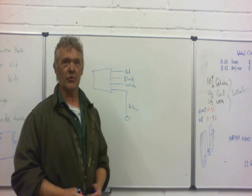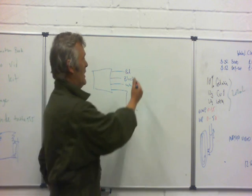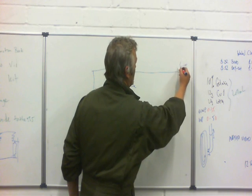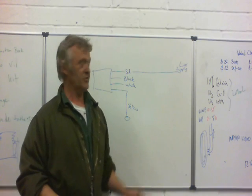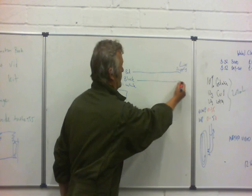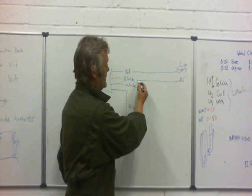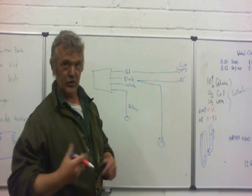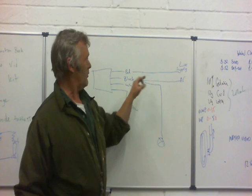The colours will change depending on which one you buy, but they're essentially the same thing. The red is obviously the live, and that one goes to your live supply — the thing that plugs into your wall, so that goes on the plug. The black one is your neutral, and you connect one to the neutral supply. Out of there you also branch off so that you've got one going to your actual lamp — the neutral on your lamp. In the UK these ones are blue, so basically you connect the two blue ones up to the black one.